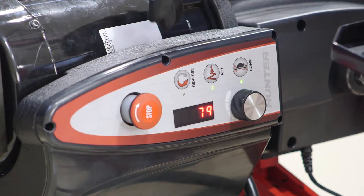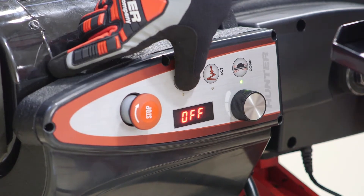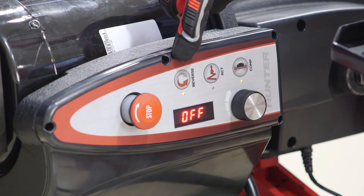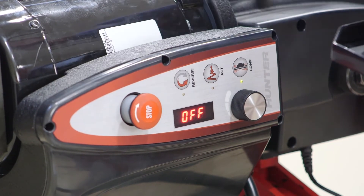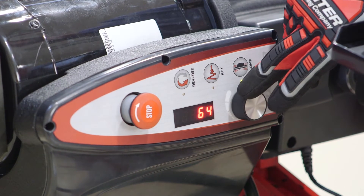I also have the ability to stop and change the direction. So if I press and hold the reverse button and release it, you'll notice now it's showing me that it's in reverse, and it's going to flash to let me know that I need to flip my bits over. In this case, I don't want to do that, so I want to run it forward. And now it's ready to go ahead and be turned on and compensated again.